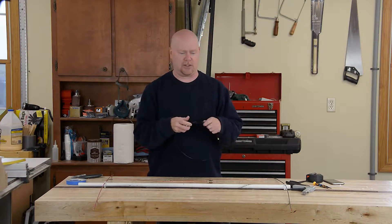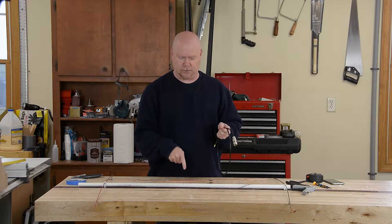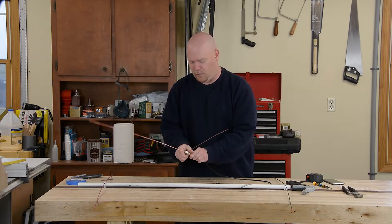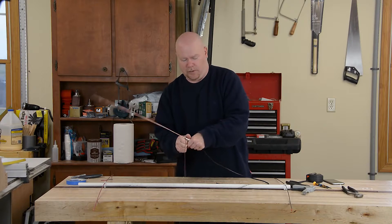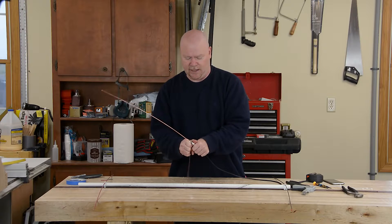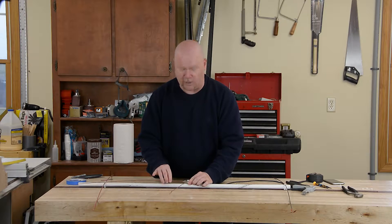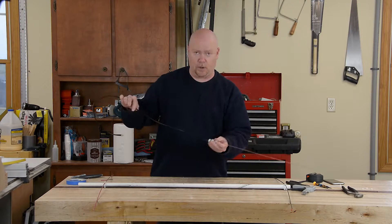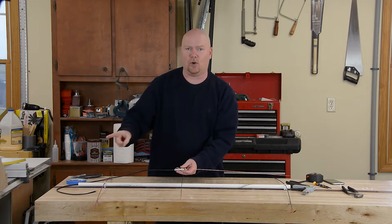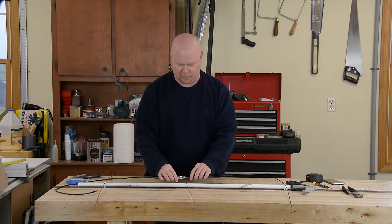Clearly in an actual disaster, whether or not you want to cut the cable and just twist the leads right onto these element wires is totally up to you. I've got a male-to-male barrel adapter in here to go from my cable to the connector on my actual antenna, and I think that's going to end up being the easiest thing to wire tie onto the boom. One thing to watch: you definitely want the cable going back towards the reflector rather than towards the front of the antenna.